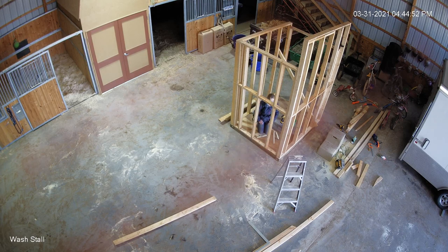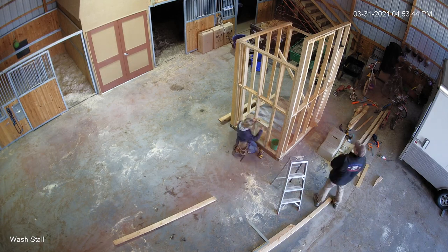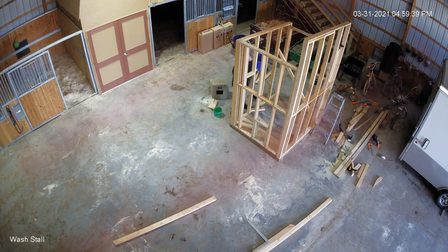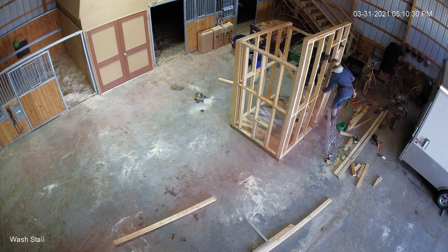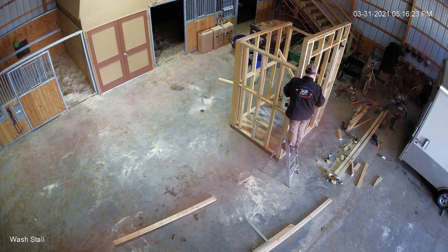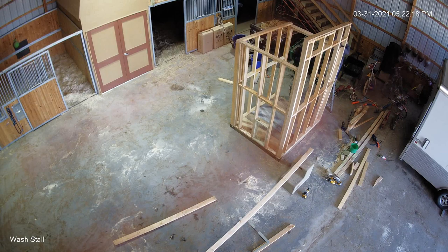As far as making this thing last, one thing I've learned is that plywood floors and chickens don't work. I like bigger, stronger green-treated or cedar two-by-tens, and then I like to watertight it with a whitewash paint made for up to 10 psi water pressure in basements. Two coats of that, and if we want a gloss we'll put a Rust-Oleum over the top. Before you go off about the toxicity — I get it, but sometimes you have to use the chemicals.